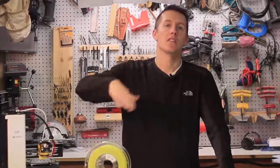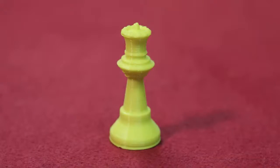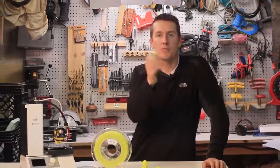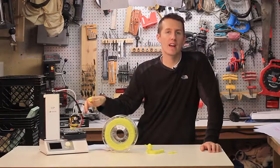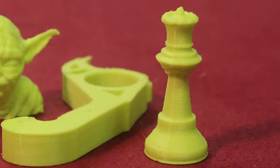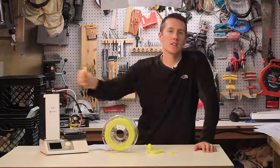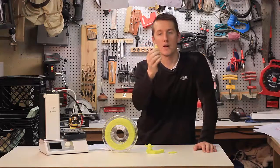Looking at the individual parts — first the chest piece. Everything came out nice and smooth and the lines were crisp. The only difficulty was on the overhang, and I think that's more a fault of this printer. I think I needed a bigger fan pushing at the speed I was printing. Typically you'd want a bigger fan or even two fans on a nicer printer. The overhang came out a little wavy, but that's because of the 0.3mm layer height and print speed, not the filament. Other than a couple of wavy lines that could easily be sanded away, all the detail and crispness on the chest piece turned out really well.